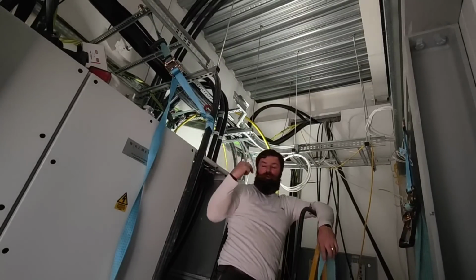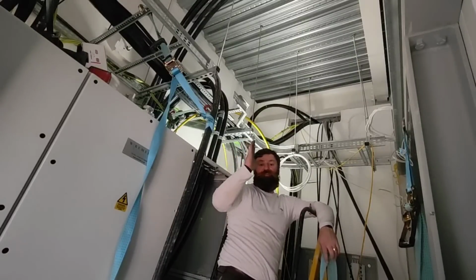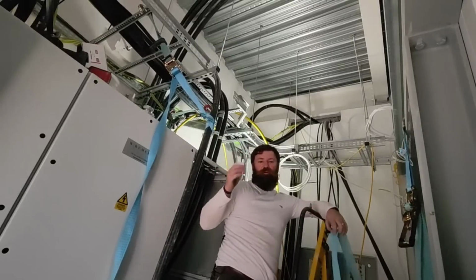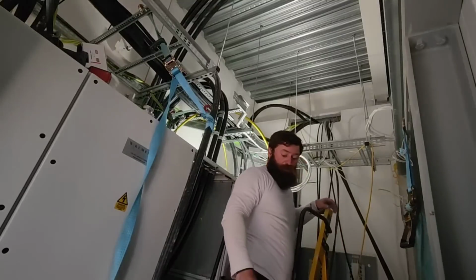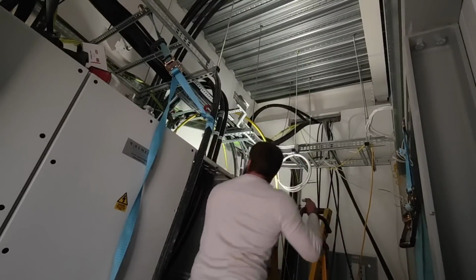Like that, with it being an alloy gland, you can't use the threads and the lock nut to pull it straight. Plus the cable this size, you couldn't anyway, but it's best to steer away from doing that with an aluminium gland, because they'll shear the thread, and then you are knackered. Right, I get this lock nut on.